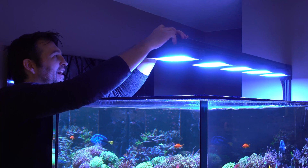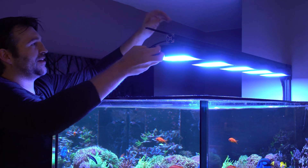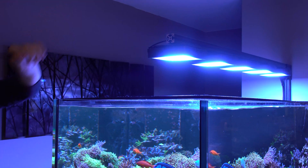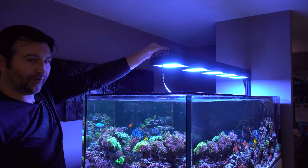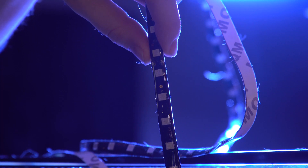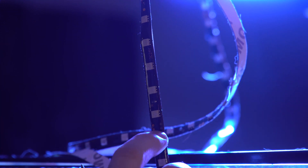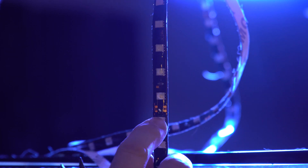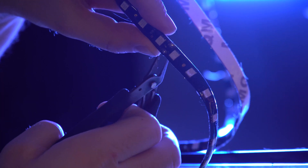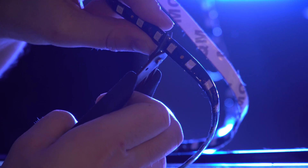Since mine is going to be hidden inside of this channel, I'm going to pop off my top cover and slide the LED strip inside of it. I'll figure out exactly how long it needs to be. Now when you look at an LED strip, generally every three to six LEDs you can actually make a cut. You can see those little lines with pads — those are the solder pads between the different strips where you can cut it. I'm going to go back one because I'd rather be a little short than too long, and we're going to cut it right at these solder joints using some side cutters.